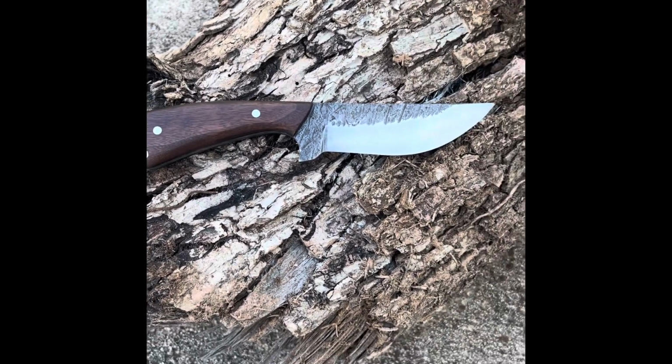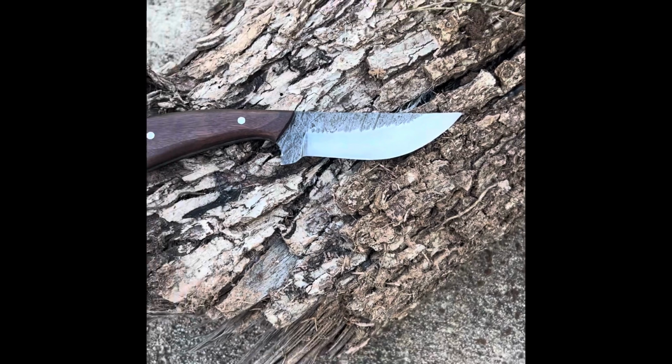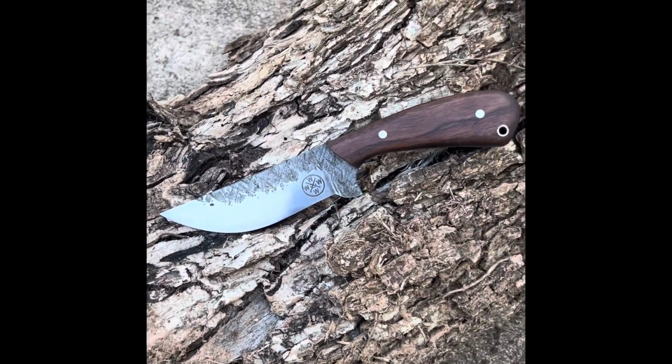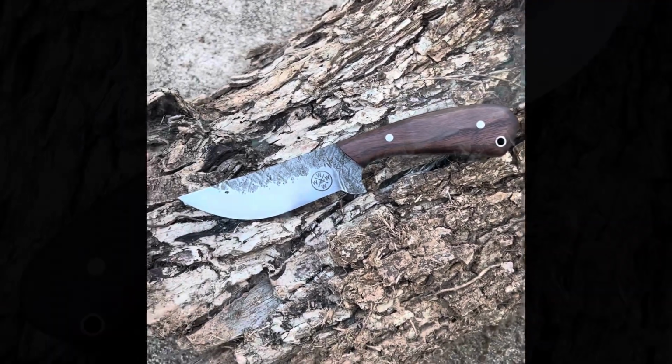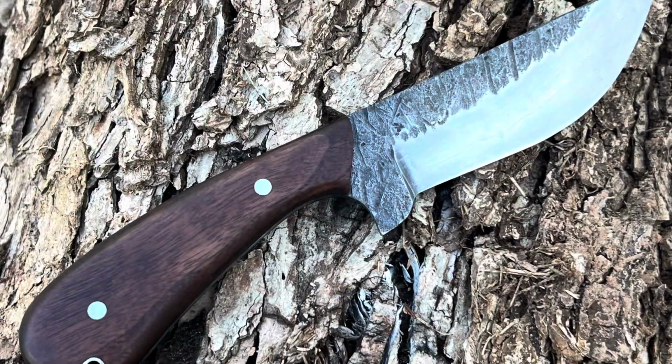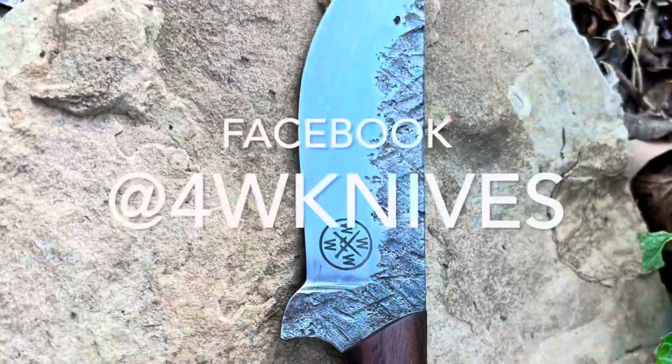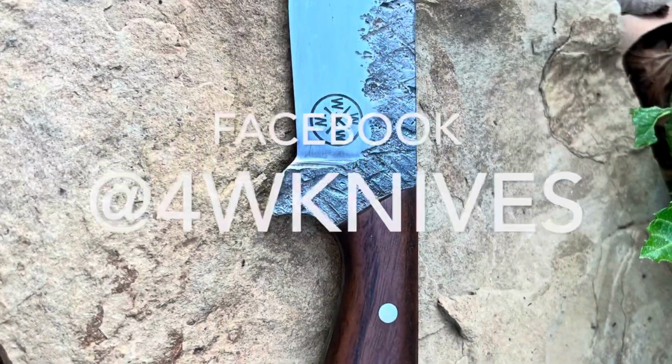As we get to see the final pictures and video of the knife, I'd be curious to hear what you thought of it. I did etch this knife in ferric chloride, but I wasn't a fan of all the different shades with this textured look, so I sanded it down pretty good on the bevel, leaving it just where it almost looked like a hamon.